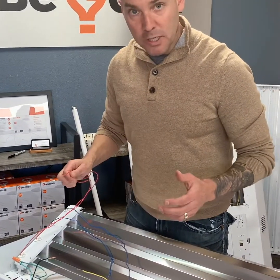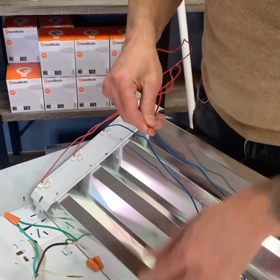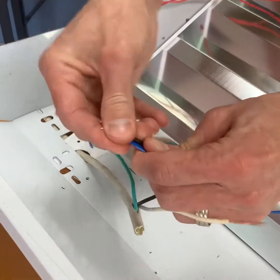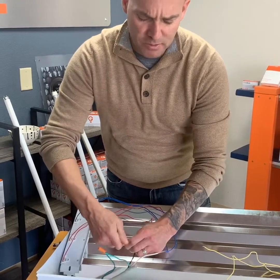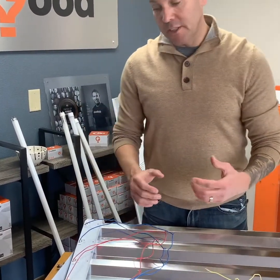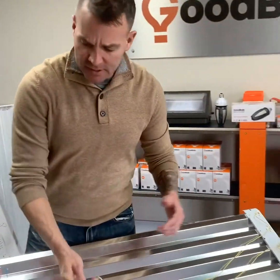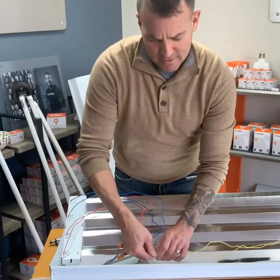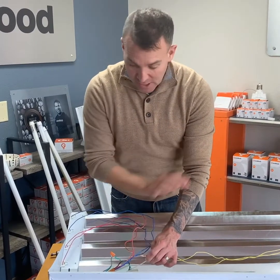The ballast is out — it's time to wire everything together. Going back to what I said earlier, color doesn't matter. I am going to connect two reds, two blues, and the black. Get better wire nuts than what I am dealing with here, but just twist that wire nut until it is nice and snug. All of those wires are now connected into one and we have a connection — power coming from your business or home is running into each one of these sockets. The next step is to connect your neutral: we have two yellows and one white. Twist on that wire nut, get all three of them together, and your neutral is connected.